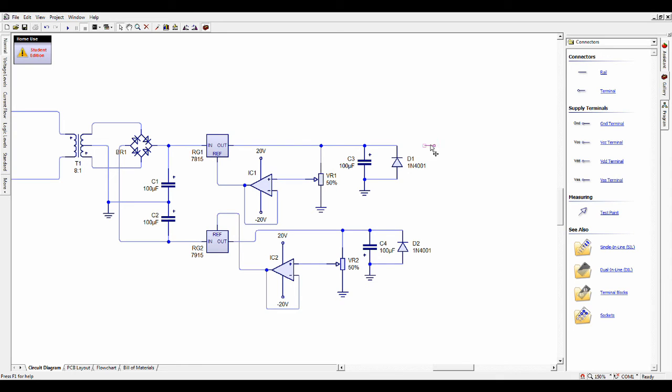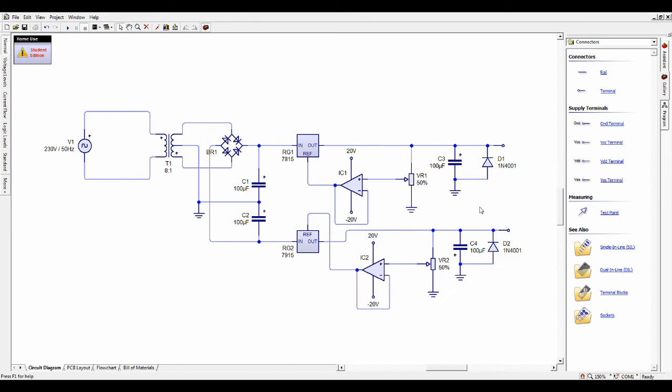So, that's essentially it for a power supply. Please be aware that if you try and build one like this, this whole transformer setup at the start you will have to build yourself, which means finding a transformer from somewhere that is center tapped on the secondary with a high enough output voltage, around about 22-ish volts on the secondary side. Now that can be a bit of a challenge, and I've yet to find one, but I haven't really been looking. You could try and make one yourself, but transformers can be a bit difficult to make, especially with that ratio and the center tap as well. The center tap can make things a bit more ugly.